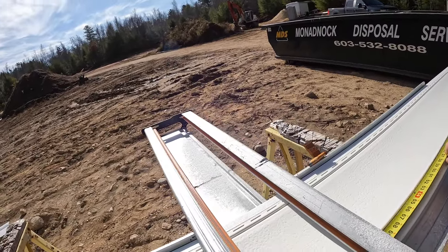And now what I'm going to do, this might be outside of the manufacturer recommendation, is I'm actually going to put a nail at the top here, as close to that rib as I can get, just to hold this piece from settling down to the bottom and then being in the wrong place at the top. I made a little track on that with my zip tool. That gets rid of that. Just a regular eraser. And there we go. We sided a whole wall. That's that.